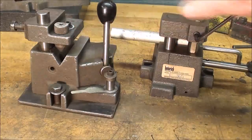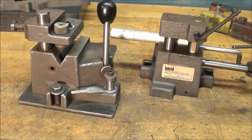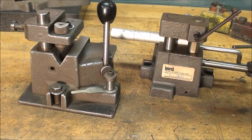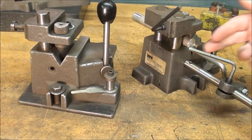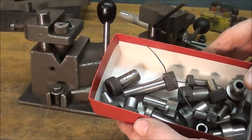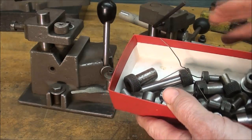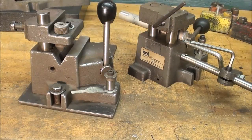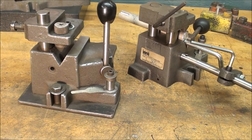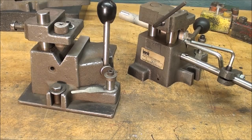These two are the same jig, the same model. I do not have one of them for sale — the price on this is about three hundred and thirty dollars and they go up from there. They come with a stop — a work stop — and you will have to buy the bushings from an industrial supplier. I don't believe Heinrich supplies them other than a liner. You'll find them in J&L and all of the industrial suppliers, so look in McMaster-Carr or wherever you want.